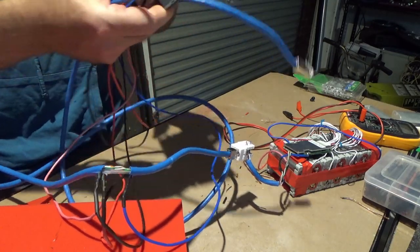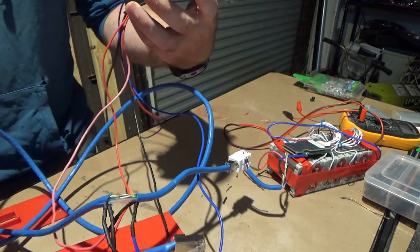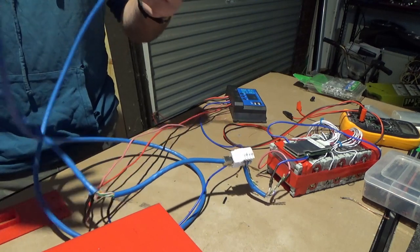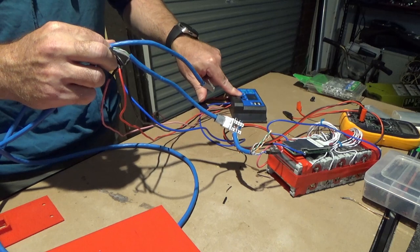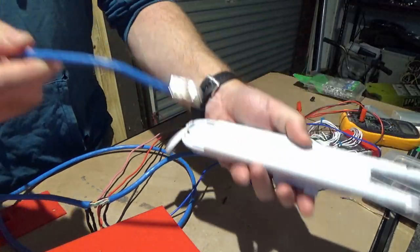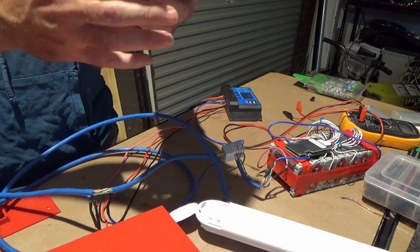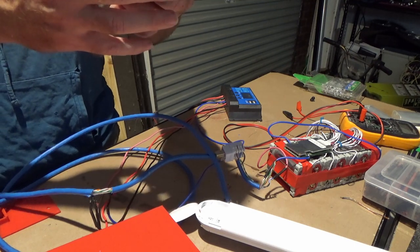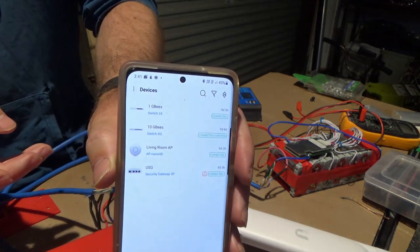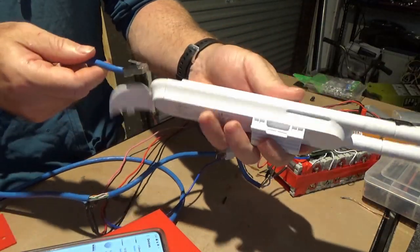So I've got the charge controller output coming into the keystone on the battery pack — brown going to the C-minus and blue going to the battery positive. When we plug this in, we can see it's happily charging the battery. It's currently sitting at 26.5 volts because it's been on charge a little today. Then we've got the other end — the DC output running at 24 volts regulated — going into the Ubiquiti. Before I plug it in, let me bring up my Ubiquiti app. I can see my device there — I've got four running at home.